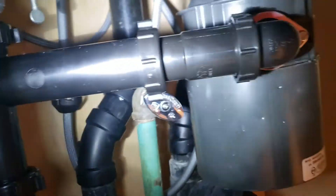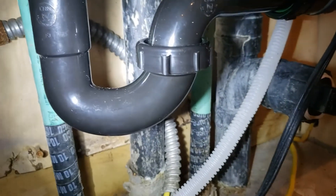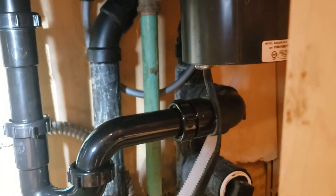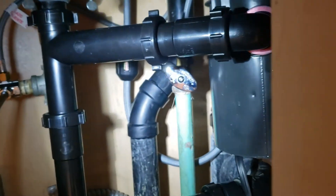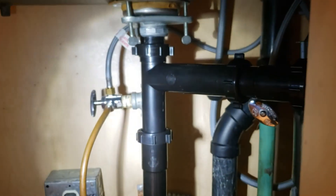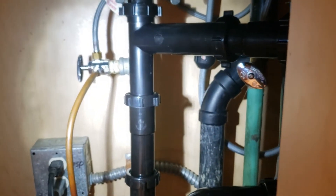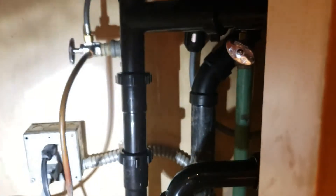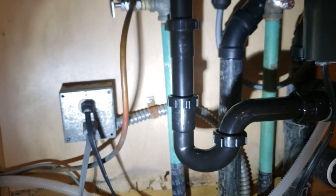Normally they just put those loops right in the way and then there's a conflict with the faucet. You can pull the faucet all the way out and back in — otherwise it would get hung up and wouldn't close back all the way. Hot side is yours; we just connected the hot and cold water. We gave you a new telescoping kit going over to the disposal — that's the 90-degree arm, our extension, and our brand-new tubular trap going up to the arm. The old piping was tilting sideways and you couldn't work on anything, so it had to come out. We'll give you a good price on the work done and we'll talk to your wife first.